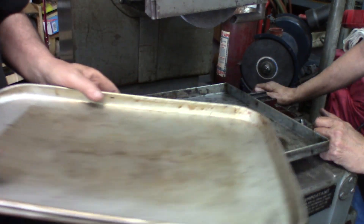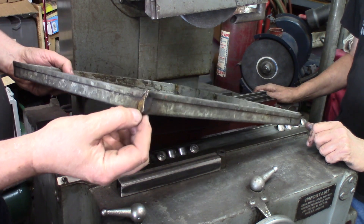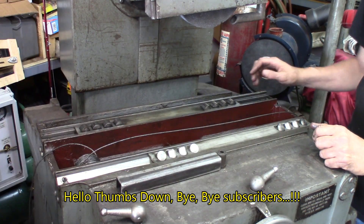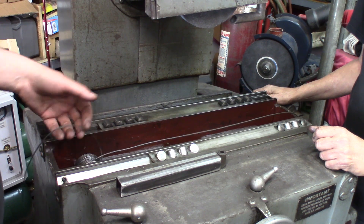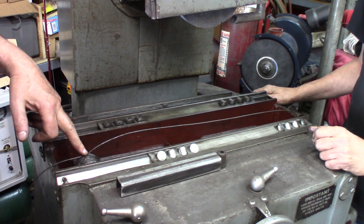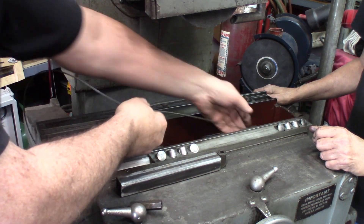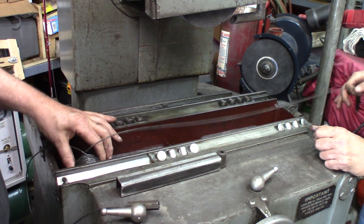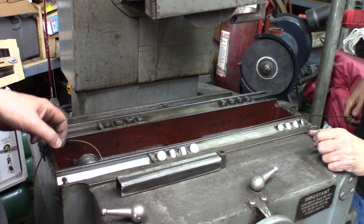This is the platter — a heavy-duty piece. This one is brazed, not welded. The platter is moved back and forth by a set of wires under tension — no spring, just held with adjustable fittings on each side. It moves with the handle. There's a little backlash in there that I'll fix up. The rollers are mainly in good condition, but I'll do some maintenance while we're at it.